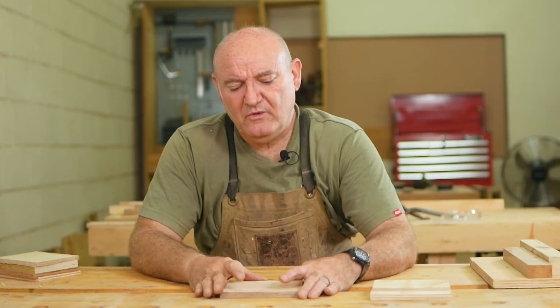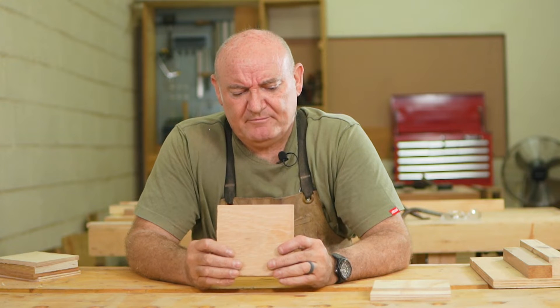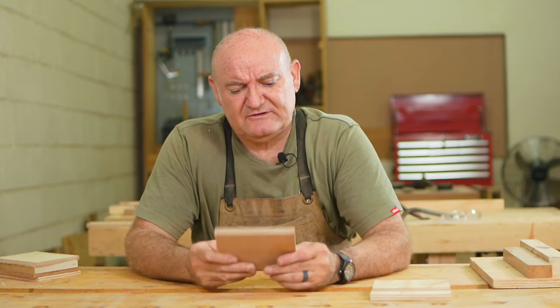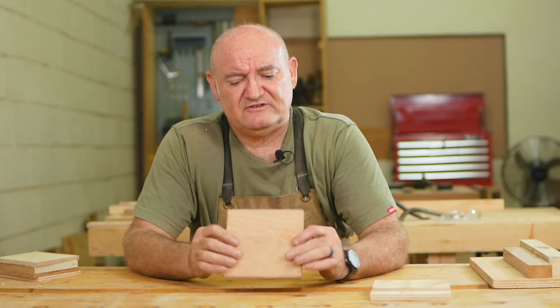So keep an eye out for WBP and think about what you want to use plywood for. There's no point overspending on something you don't need to, but if you're going to do something, buy the right product so you don't have a disappointing outcome. This is marine grade plywood — it's got waterproof glue between the layers, it's got two very good faces. You're not going to get a pine marine ply because it doesn't exist. You're going to get something with a hardwood face, another hardwood face, and a whole lot of good stuff in between.